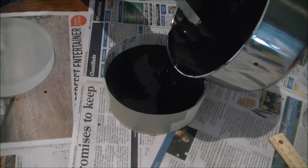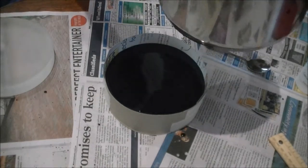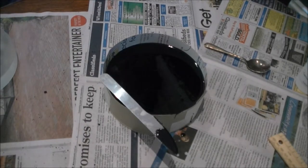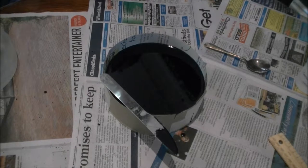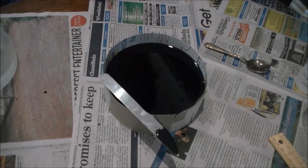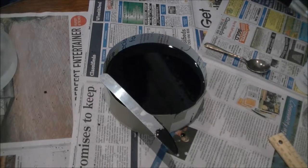I'm going to pour it straight on, aiming for about half to a quarter of an inch depth. That should be more than enough. I'll let it cool down a bit and then start scooping it to the center, because when we press the mirror — which is concave — having a mound in the center will help avoid any air bubbles.